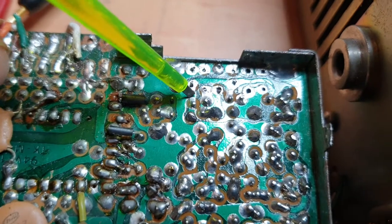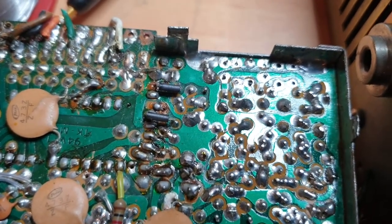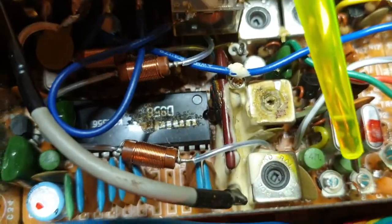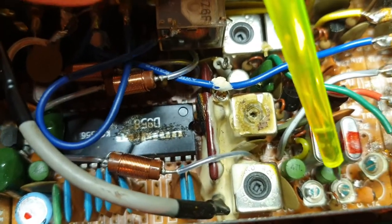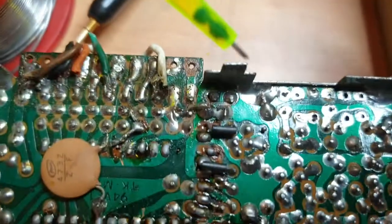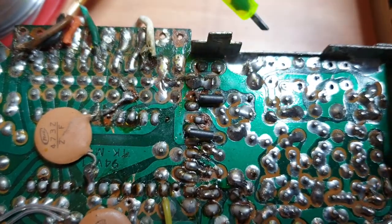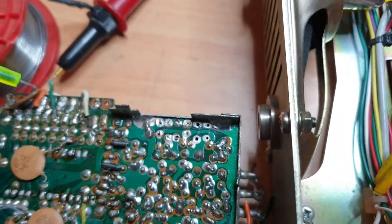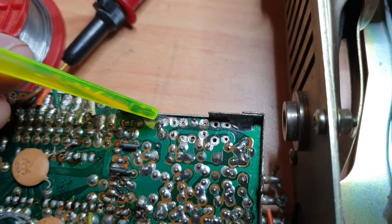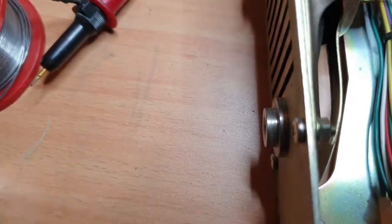This is also a nice quick way to prove the concept — that yes, in this case TC2 is dead. What we've done is come over to the capacitor right next to it. You can see the trimmer and the capacitor follow the same paths as they come through.